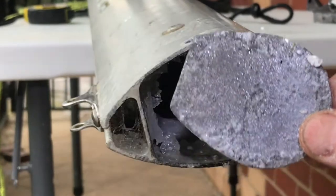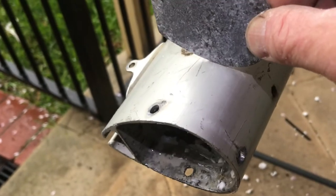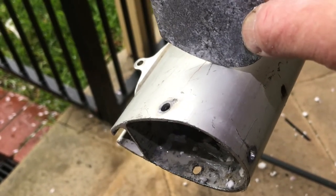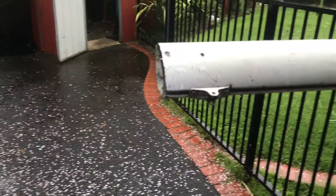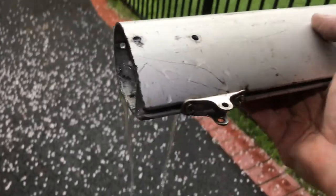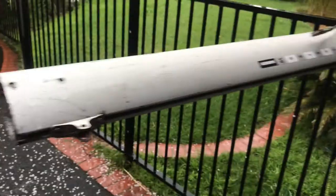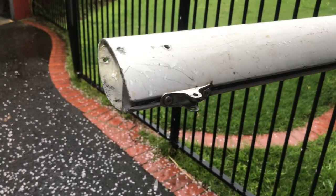We're going to replace that with a different kind of plug. There's an old main halyard horn in there. These three rivets weren't actually doing anything — all they were doing was anchoring the plate so it didn't wobble. The old plate was pushed up against the three rivets and then siliconed many years ago, so those holes will have to be blanked off later on. I've flushed the mast out with a bit of fresh water to get rid of all that excess salt water. That's one good thing — get a little bit less water in there, dry it out a little bit, and then put the mast spanner on.